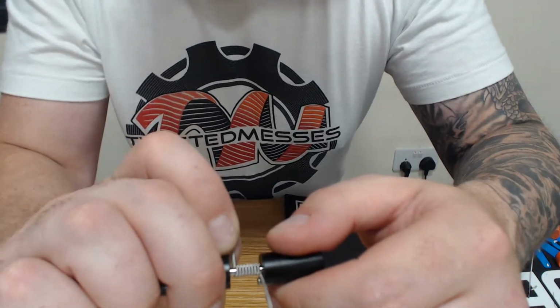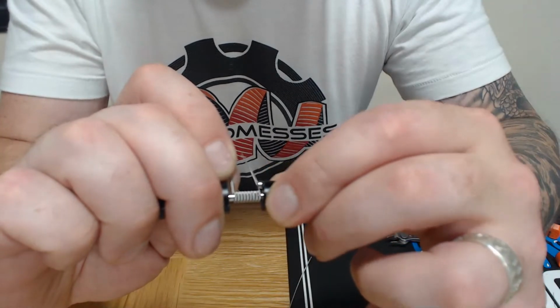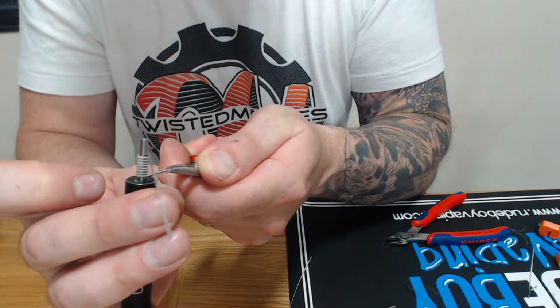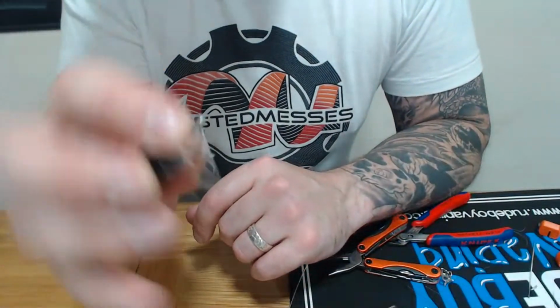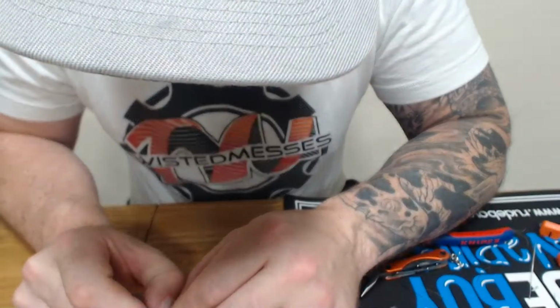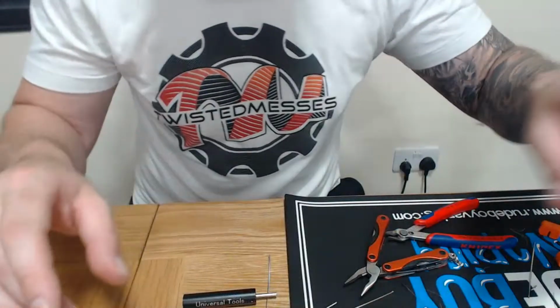8. Now, because it's 0.35, it's very springy. So what I do is I go an extra half wrap because it's going to spring back. I'll show you now. That's actually 9 wraps there, but when I let it go, it's going to spring back like that. So that's about 8.5. So I need to pull it back a bit. I find this is the tidiest way and makes the coils look as tidy as possible. So then I have my 90 degrees there, and I just get my thumb and bend one leg to match the other, and make sure both legs are even. And there we go. There's one coil. There we go. Pretty good.